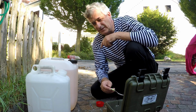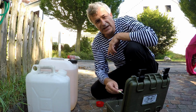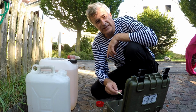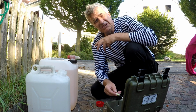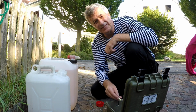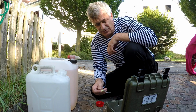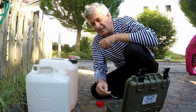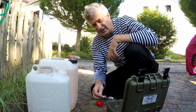The last thing which is dissolved in the water is tannin. Tannin is isolated from oak trees. This is a natural compound which prevents the growth of bacteria. It's an acid also, and it prevents the growth of bacteria. On the other hand, what you also have in the final compound is starch. Starch is necessary to bind dissolved compounds and allow their precipitation.